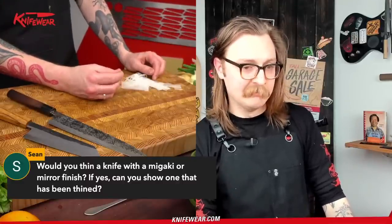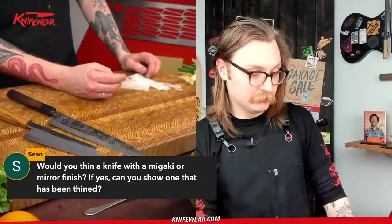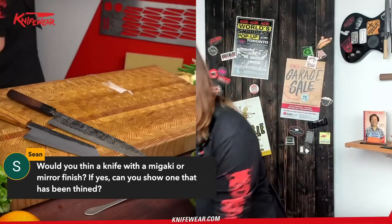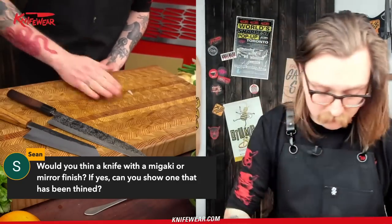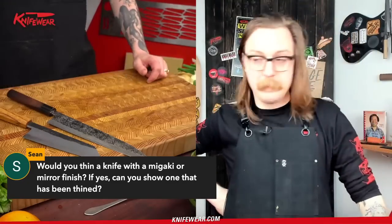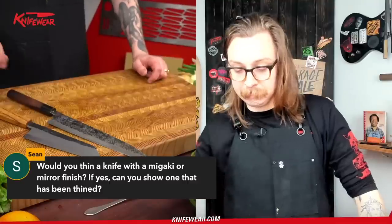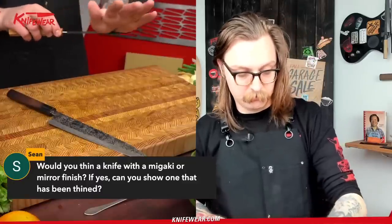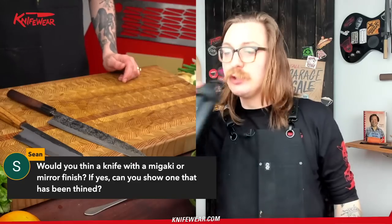All polishing is always such a house of cards when it comes to this kind of thing. Even when you're using it, it's going to eventually get scratched up. So I prefer just to let it patina and call it a day. But if you really wanted to polish something up very nicely, you would do stepping stones of grit, higher and higher, and usually you'd want a softer stone. Basically, it's just making sure that all the scratches from the previous stone are gone.